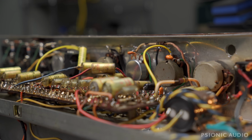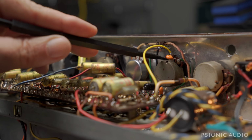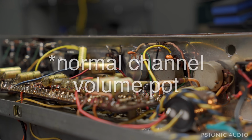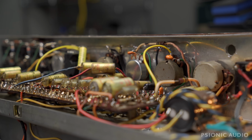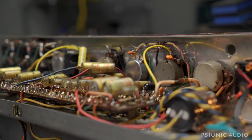All right, you can see the original vibrato trim volume pot and original Brilliant channel volume pot are reinstalled back where they have been for many decades, but the bass pot was defective. And yes, this is an Alpha, this is not a CTS, because the current production CTS 500K audio taper pots have a dead zone at the lower end of their travel. They just go from nothing, nothing, nothing to quite loud at about 9 o'clock. And these Alphas do not, and these Alphas sound just fine. Thank you very much.